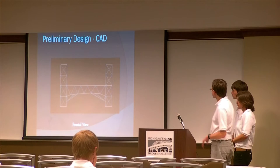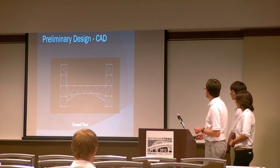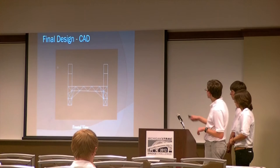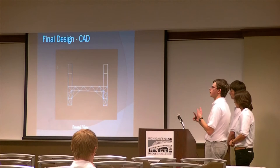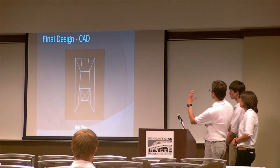Here is a preliminary design we had in the CAD software, which is where we started with the idea of an arch. But right where the arch meets the towers is where we made a big change, as seen in the CAD drawing of our final design, where we removed a lot of unnecessary pieces. In the towers too, we found that the cross beams — the X shapes — weren't necessarily helping anything even though they looked like they should be. In the final design, we redid the towers to where we just had the essential beams and everything else was only support we thought was actually doing something.